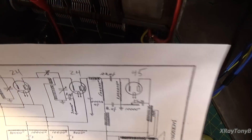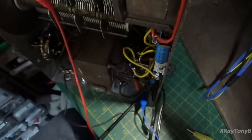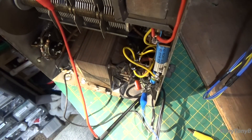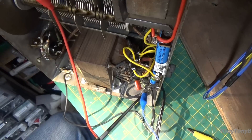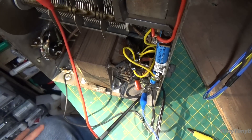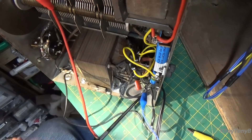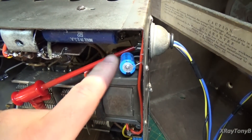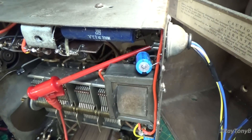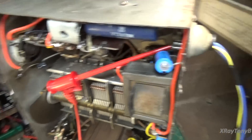I've been going over and over through all of the wiring, making sure everything's where it needs to be. As it looks right now, I'm fairly confident — not 100%, but fairly confident — that we got most of it correct. With the 80 rectifier in there and the power supply wired up, you can see I have my probe connected to the output of the field coil on the third capacitor. We're going to check the voltage right there.